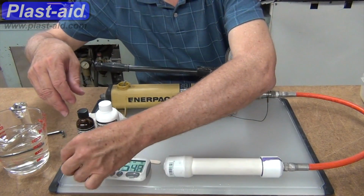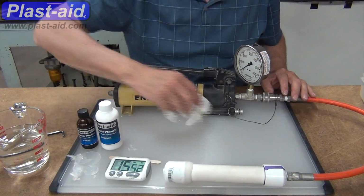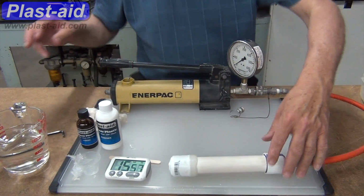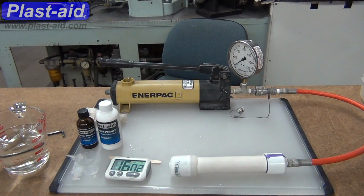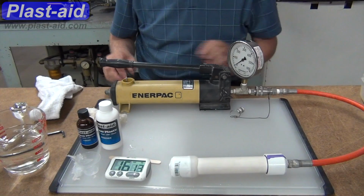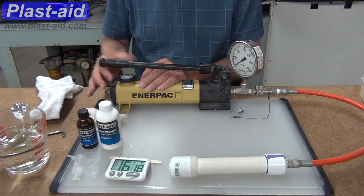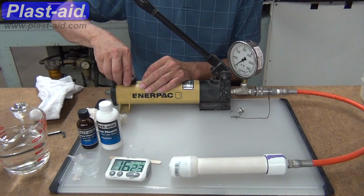It may stick a little bit. The real important issue is that it'll chemically fuse or polymerize to the surface, where the molecules will attach themselves to each other. In the case of PVC, that occurs. In the case of polyethylene, the molecules are such that they don't get recognized at all. And therefore they don't bond, or they don't stick, or they don't chemically fuse.